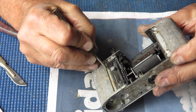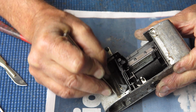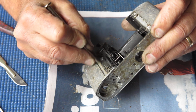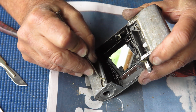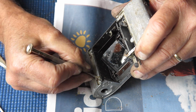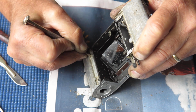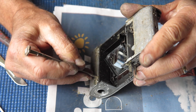Most likely it was something mundane, like the shutter really needed to be serviced because of the usual problems with leaf blade shutters. Oily blades, build up of dust and dirt, things of that nature. Things that would have been fixed simply by a straightforward service. And instead, we're left with a variety of weird problems, like that mirror being pushed down out of position.